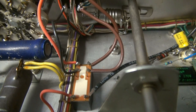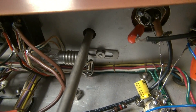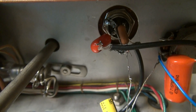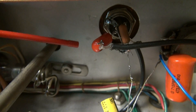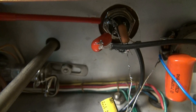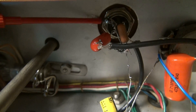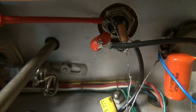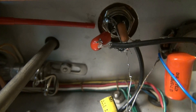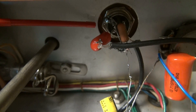The negative side of that relay — I used a piece of coax to reduce noise — goes to the new mic jack, which is hidden up here. Now, the bummer of doing this update: to mount the mic jack on the front panel, you have to open up a hole on the chassis to clear the nut. You can't fit these mic jacks in the quarter-inch gap between the front panel and the inside of the chassis, so unfortunately you've got to pull the face to do this.